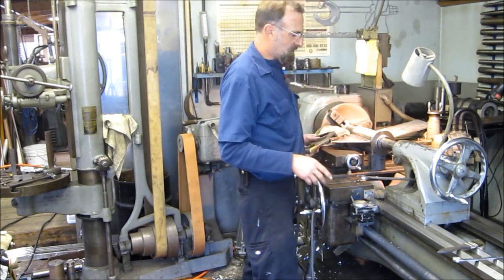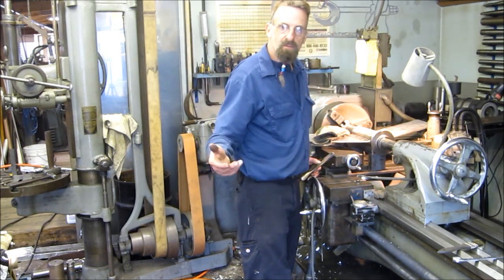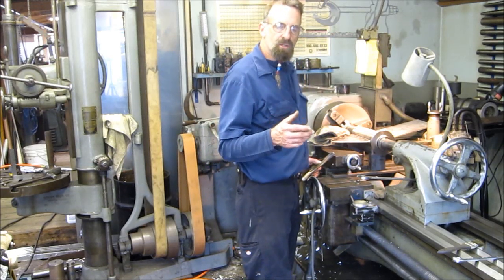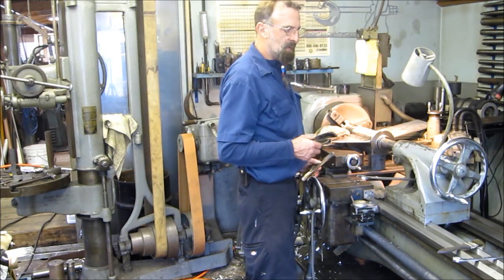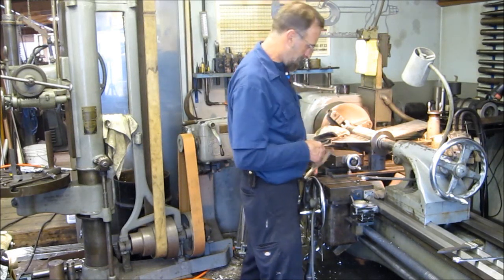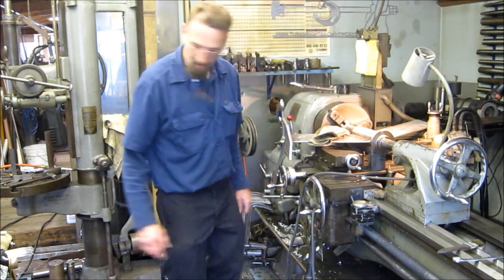Also, any welding that you're doing, you want to protect the ways on the lathe. There are surfaces on the mills and drill presses. And you want to make sure that you're protecting those areas from arc and also from splatter. Most of the time, cast iron, the splatter will come off, but it will give you a little blend there. And you have to make sure that it's all smooth. Alright.